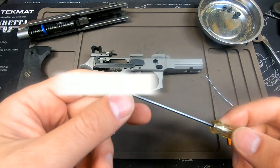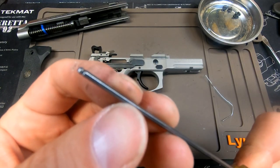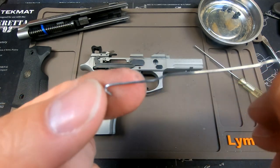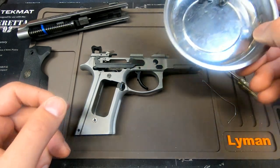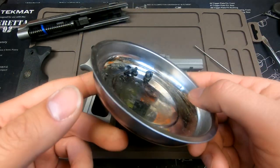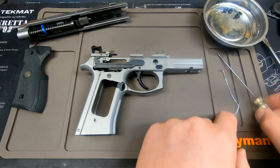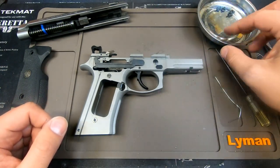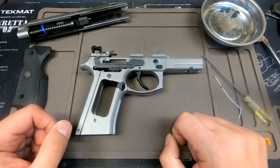Before we get started you're going to need a couple of tools. I use a 5/64-inch hex screwdriver — mine has a little notch at the end. You'll also need the little fancy fish hook made out of a paper clip that I've shown in a prior video. You should also have a magnetic parts bin or cup — it's about a dollar at Harbor Freight or free with one of their coupons. I highly recommend this for your work area to hold springs, screws, and all the parts being taken off today.